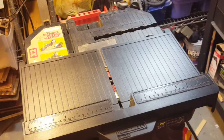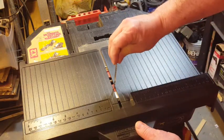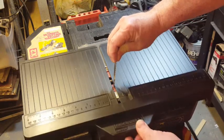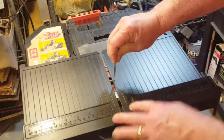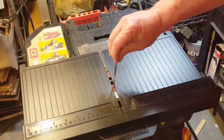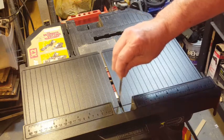Using the same line of thinking, when you're making cuts using the crosscut sled, you want the blade to be perpendicular to the surface of the sled. As you push the wood using the sled through the blade, you're going to get a nice 90-degree cut. The last thing you want is for the blade to be twisted at all — you want it to make a nice 90-degree angle with the sled.